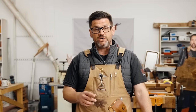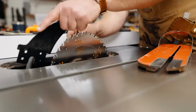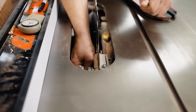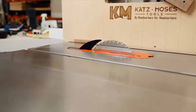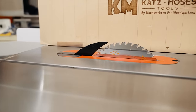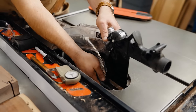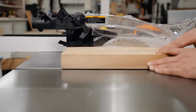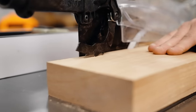Number one, first and foremost, is to use a riving knife, splitter, and/or a guard. Riving knives are a piece of steel on modern table saws that ride right behind the blade — a little bit thinner than your blade — and keep the board from turning into the blade or pinching it. Splitters are very much the same but typically used on older table saws before riving knives were invented, attaching to your throat plate. Guards are very much like a riving knife but also have anti-kickback devices on both sides that will grab a board if it's shot back towards you.